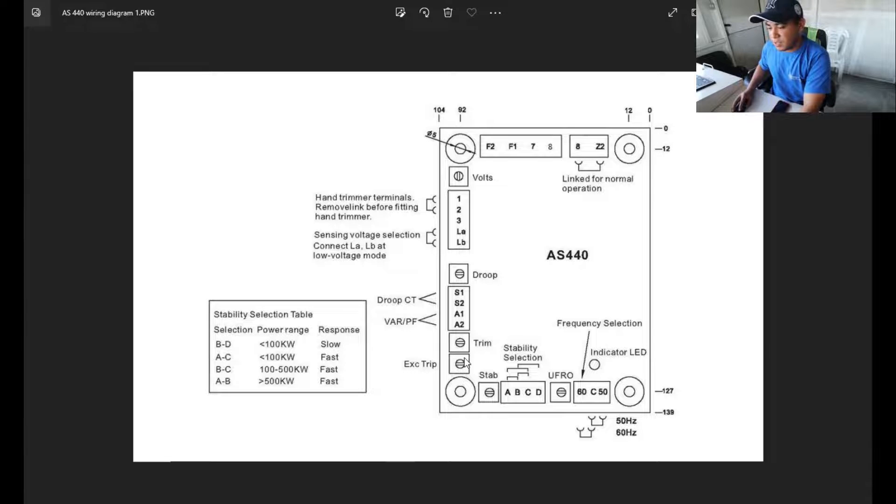Around here is your excitation trip point. As mentioned, 360 degrees equals 100% trip point. If you want 50% or 25%, you set it by percentage. For example, if you don't want to allow high excitation, you set the excitation level to 50% or 25%. This will automatically and internally trip the AVR — it will stop giving excitation if the level is exceeded. Adjust this trimmer to control the excitation limit.